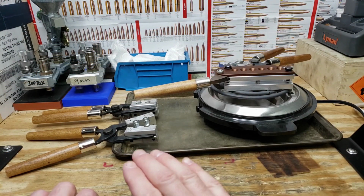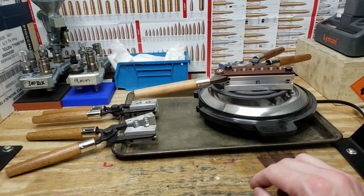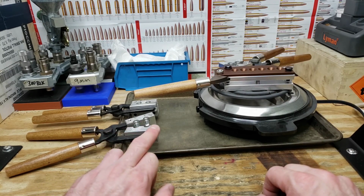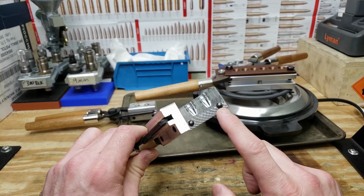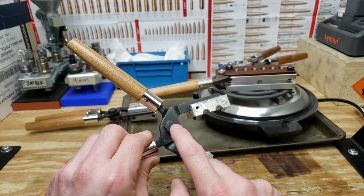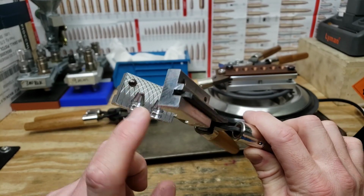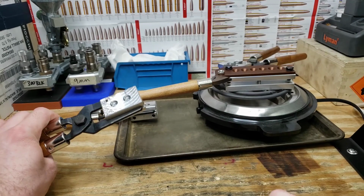As far as putting the sprue plates back on these 2 cavities and this one here, we have to make sure to lubricate our screws and the sprue plates themselves, but avoid getting it into any of our cavities. You also have to add a little bit of lube here and here on these pins, as well as your handles and this screw here. But you want to avoid any oil in your cavities, but you're going to hit them here, and your sprue plate, you want a little bit of lubrication on that.